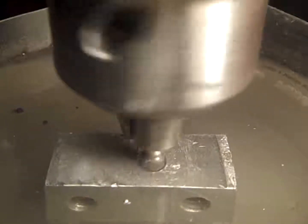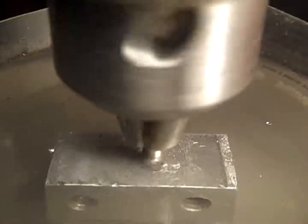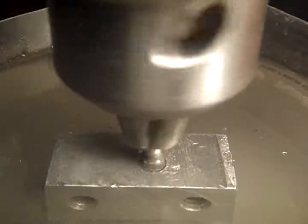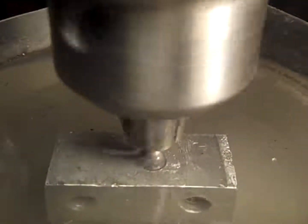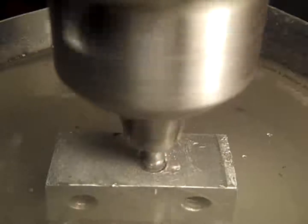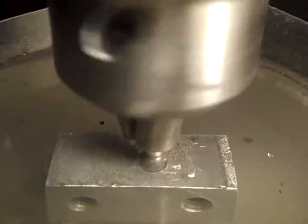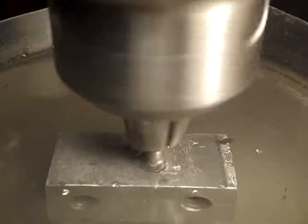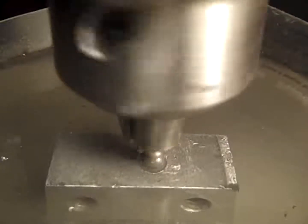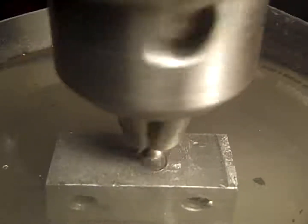That's a pretty good view, eh? Yeah, these diamond hole saws work pretty good once you get the hang of it. Contrary to what you might think, you want to use them at slow speeds. Diamond cuts well at slow speed. And these are cheap, I'm telling you. They're probably the cheapest ones on the market, and the diamonds are all different sized, but they still work.